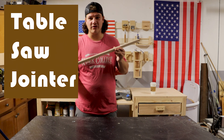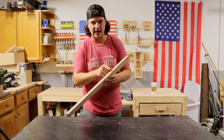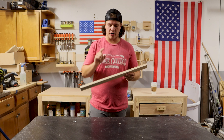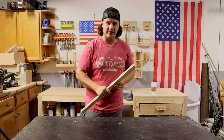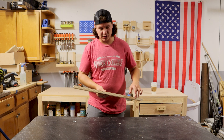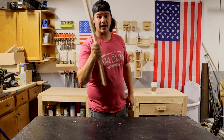The next jig is just a piece of plywood — but what is it exactly? We've got this notch cut out, cut all the way through on the table saw, and this is for jointing wood. I use this thing all the time when I'm jointing wood on my table saw since I don't have a jointer. We actually have a video all about this and a few other ways to joint wood without a jointer — check that out in the description. All you have to do is clamp this down to your table saw, the blade runs right up against the side of the piece, and as you run the board through it joints that side against the fence. Really easy and cheap way to joint wood.